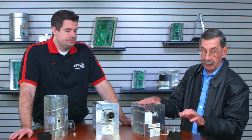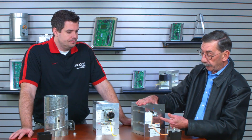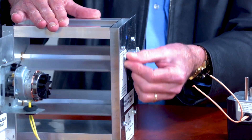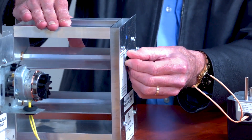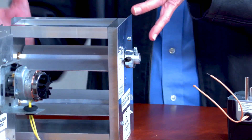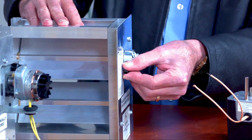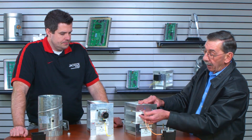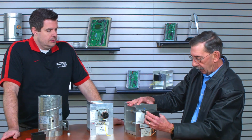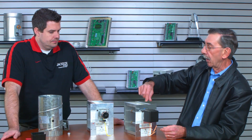Another thing that can cause a problem has nothing to do with the motor — if you shoot a zip screw in the wrong place, you'll have a screw grabbing the blade. When you have the actuator off, make sure the damper blade is free and moves freely. If you go to move it and it goes clunk, now you have a mechanical problem — a zip screw stuck in there, or it got warped or bent. But if it floats freely, we're good to go. Install the actuator with the blade in the wide open position and screw it down.